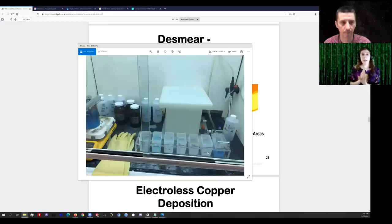We don't care about adding more copper on the large foil surfaces — the copper is already thick there, so we just don't try to prevent it; it's a very small amount. But while that's happening, copper is depositing on those clusters of silver, covering all the silver and continuing to grow on itself. So instead of all these clusters of silver, you end up with a growing continuous surface of copper that goes from one end all the way to the other, as long as you have very good circulation of the solution.